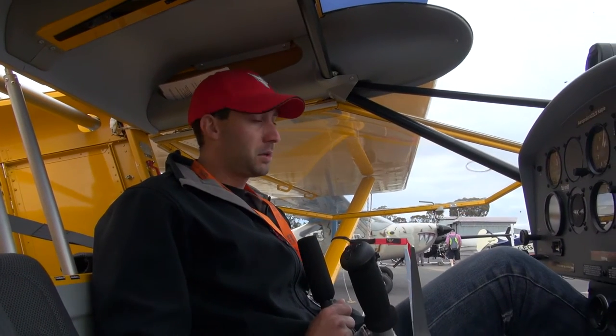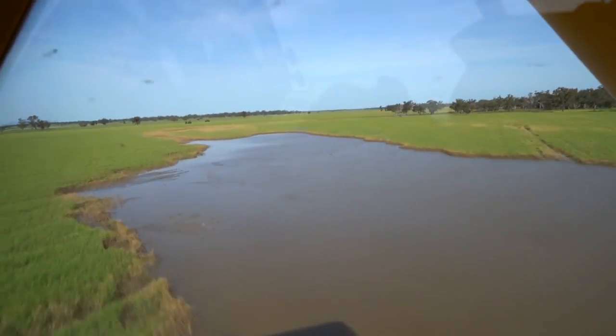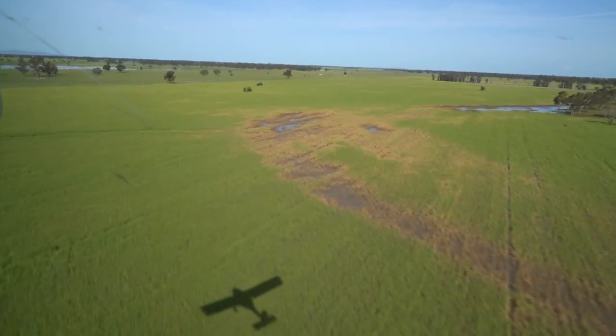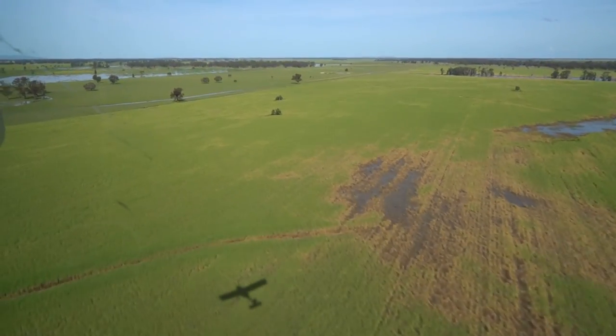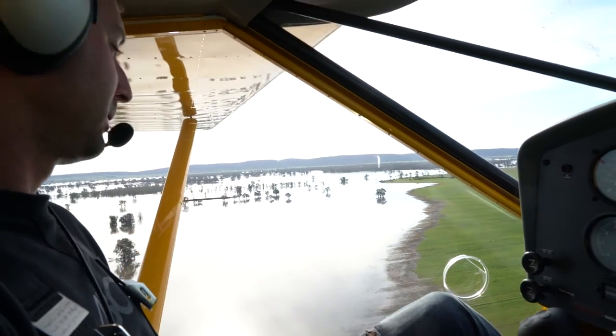As part of the features of the aeroplane, the real advantage is that you can muster animals quicker, you can inspect the fence line much easier, get great visibility, and really enjoy comfortable and very safe flying at very low airspeed. This aeroplane will fly well above the stall at 35 knots, doing steep turns, of course with the right training. You can really get great capability out of this aeroplane to do the job that you need to do.